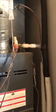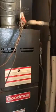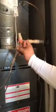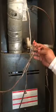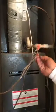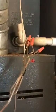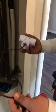We're gonna come to the unit right here. We're gonna wire up the flow switch with the thermostat wiring that goes from the actual thermostat and goes to the inside unit right here. We're gonna look for the one that is for cooling, which is the yellow one. I'll show you in a bit how to hook up the flow switch to those wires.